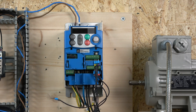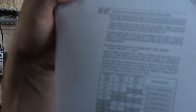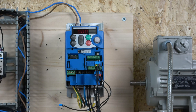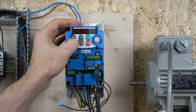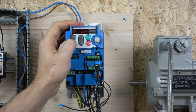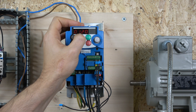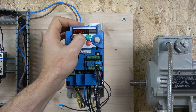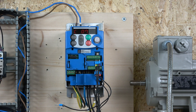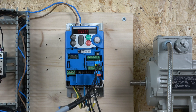Let me put the cover on and we'll have a look at how it works. By default, all speed parameters from C5 through to C11 are set to zero, so you need to change them to your desired frequencies. I've changed most of them already — we'll change C6 on camera, setting it to around 8 Hz or so. Make sure all C parameters from C5 through C11 are set to whatever speed you want.